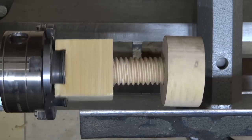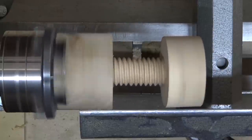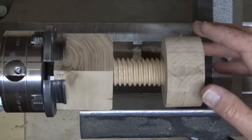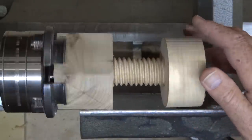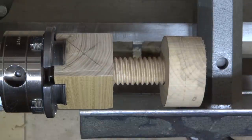I'm going to glue it on there, give the glue time to set, then come back and turn this cap. It's in there now but it is not running true. I think the threads are running fairly true but I've got a problem with the cap, so I'm going to have to true that up. This is not steel, so I know there's going to be some degree of flex in here and I'm going to have to make very gentle cuts.